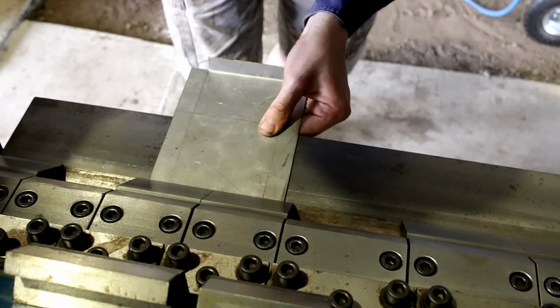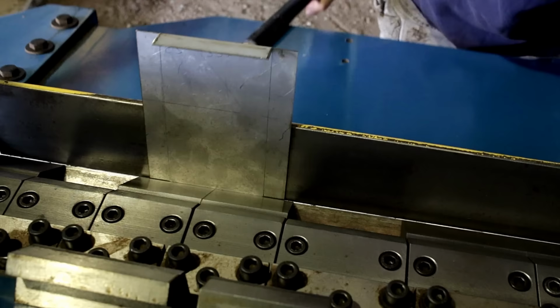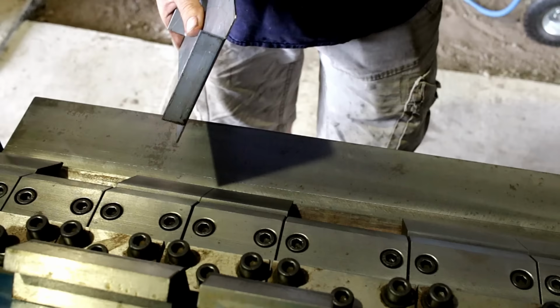I always say that when you're folding sheet metal, it's much better to go a little bit over. A little bit, not like 2 kilometers past where you need to be. It's very easy to bring it back because the metal has memory. Sounds strange, but it'll always come back to where it was. It's kind of like a homing pigeon. Only metallier.